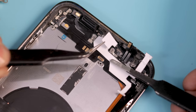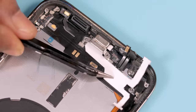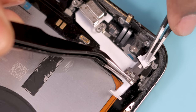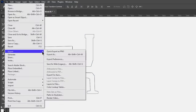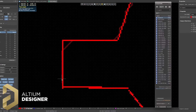USB-C will sit at the bottom of this layer, which will be bent. Another side of the PCB will pass through and connect with one side of the C91 board, and another side from there. It is a complex design, but everything looks fine. So I exported this layer and dragged it into Altium Designer to design the PCB according to the layout.